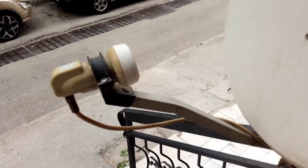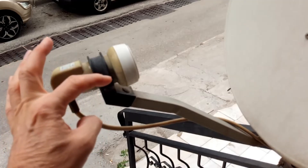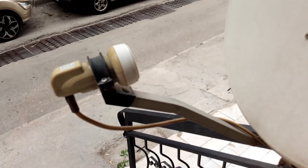We can do this in two ways, depending on the situation. If you can reach the LNB from where you are, you can unscrew these screws. If you can't reach the LNB, there are two nuts on the back of the satellite dish — one on top and one on the bottom. We'll remove these without moving the antenna, and then replace them.